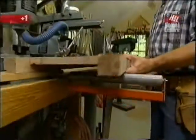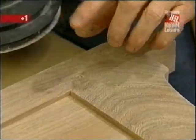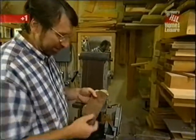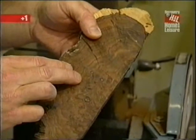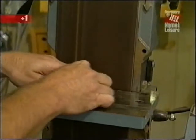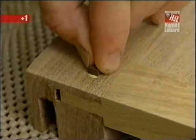Of course, I have no choice with the ones on the front because I can't fit the panel in the mortiser. Before installing the pegs, I want to sand all the intersections flush because the pegs are proud of the surface — I don't want to grind those down. Now for the pegs themselves: I bought some ironwood in Tucson, not sold by the board foot but by the pound — six dollars a pound. I ripped it into quarter-inch square strips and rounded over the end — the part of the peg that will show. Then I use a glue injector to put a bit of glue in the mortise, set the peg in position, and tap it in.